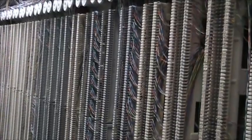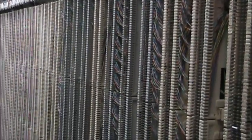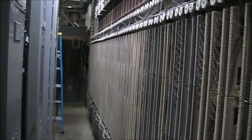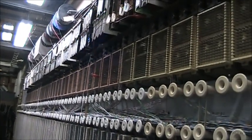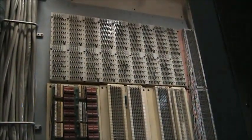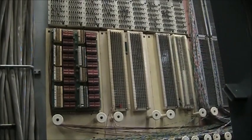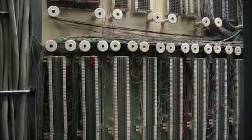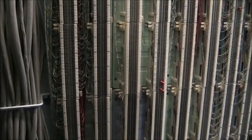However, I'm only having two to three lines on each line card, so this works out very well and reduces the amount of space needed to terminate the additional hundred-plus lines. We're also looking at the 620 panels on the 641, 642, and so forth. Here I'm displaying some diode matrix blocks — two different types — as well as the yellow boards that have special service equipment connected. Below that are the green back boards, and that is the cables that go to the step-by-step and the number three crossbar system.